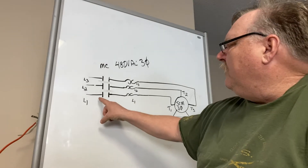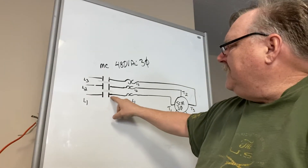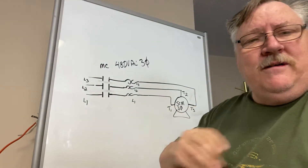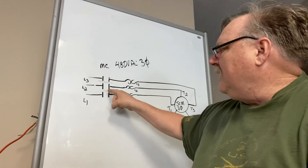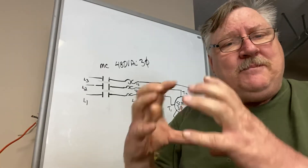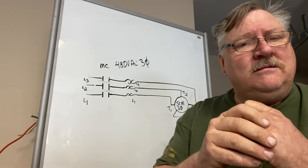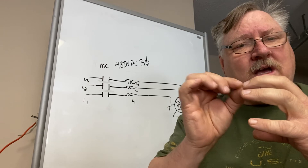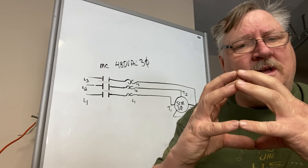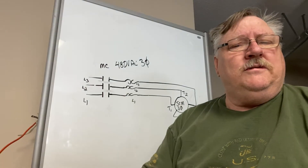You can also check your voltage from the load side — check from your T-side voltage to ground. If you get 277 volts on the line side and then on the load side you get, say, 100 volts, you've got a bad set of contacts. That contact is going to be bad. And that happens because not when they make, but when they break — you see that flash inside the contactor that's pitting those contacts each time. Usually once in a while it's not an issue, but if you've got somebody constantly hitting the stop and start button, that'll destroy those contacts.